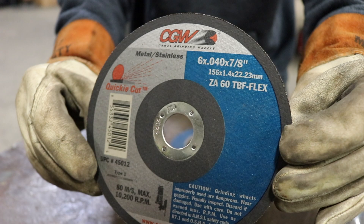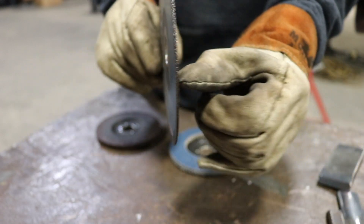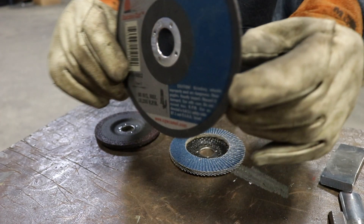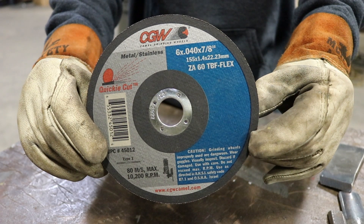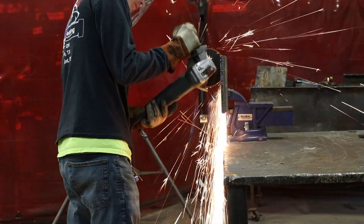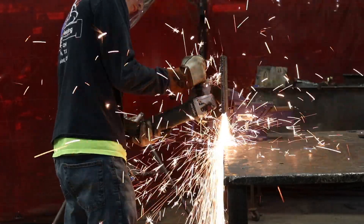When it comes to prepping your coupons for a bend test, you have to make sure that you're using the proper grinding wheels and cutting discs for the task. Here's an example of a cut-off disc commonly referred to as a whiz wheel. This is the thinnest disc that comes in your kit and this is what we'll use to cut out our coupons. Make sure before you do any cutting or grinding that you secure your coupon to your table or in a vise.